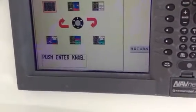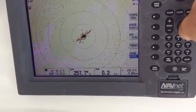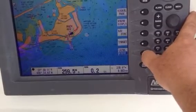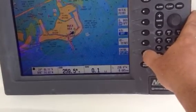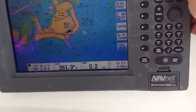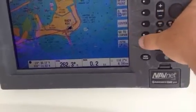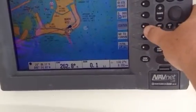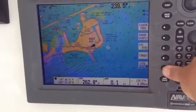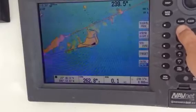Radar overlay — function is on Radar. You can put that function on Plotter, and then you can have your navigation information here. Go to cursor, center back up on boat, bring it to Radar, and you can range in and out — the radar will range as well.